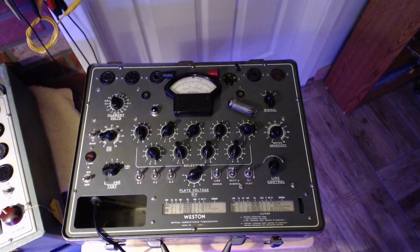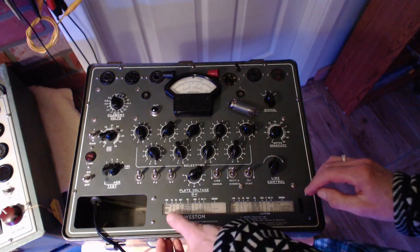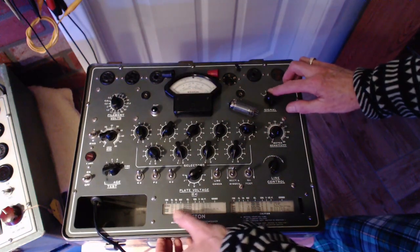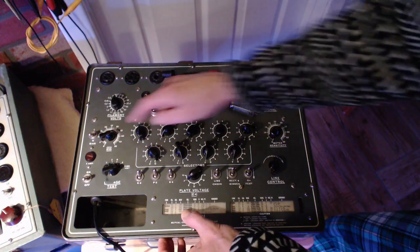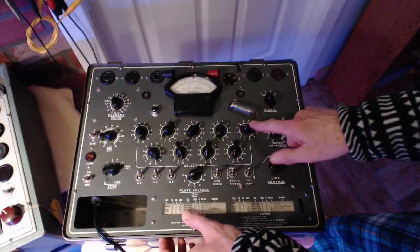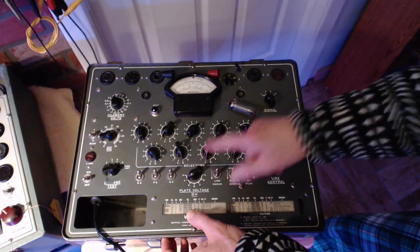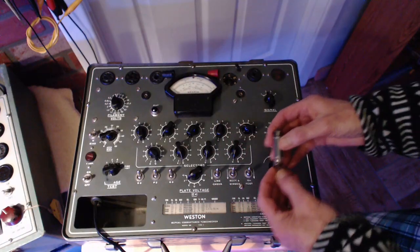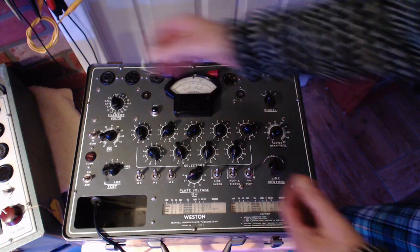Okay, let's test this guy as a 6AQ5. Oh, better double check. Here, 6.3. Signal level 2, 36H. For bias 51763. 51763. 4G00. 4G00. Be interesting to compare these settings to the EL95 settings. But there are no EL95 settings. So, here we go.